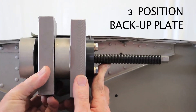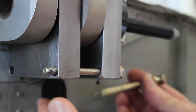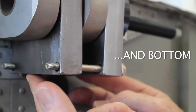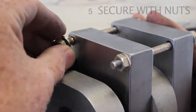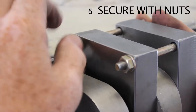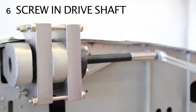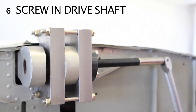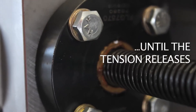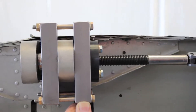Our tool does this by applying balanced pressure around the entire circumference of the bushing. It also transfers the pressing force into the tool's back plate rather than risking damage to the wing's attach fitting. The potentially lengthy and difficult job of removing these bushings is thus relegated to the twist of a socket wrench, and the attach fitting is left with minimal effect.